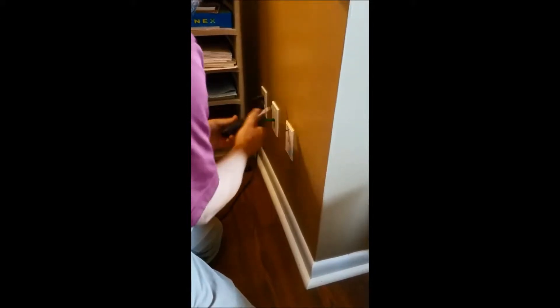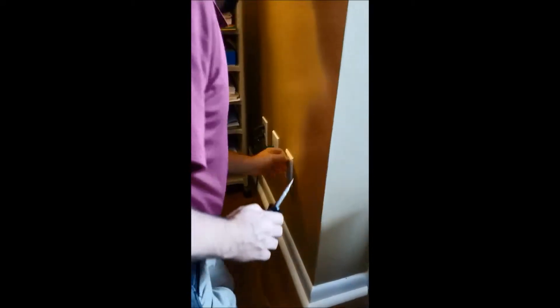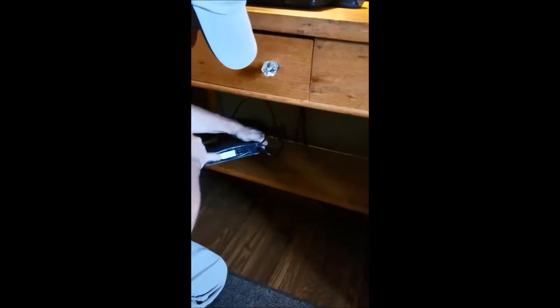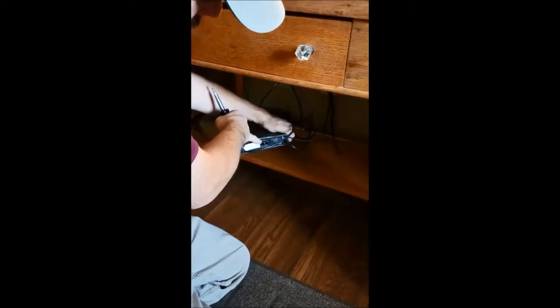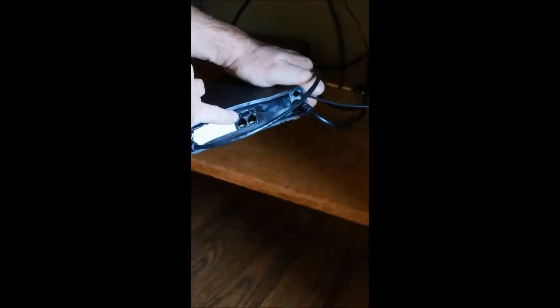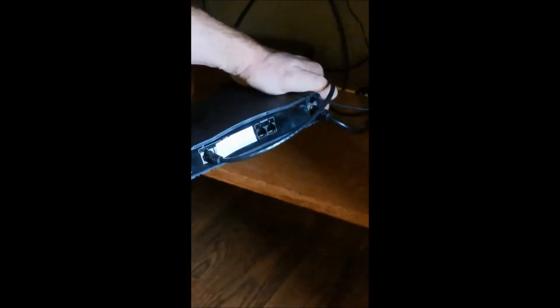During the installation of the phone we've got many options. We can hook the phone up directly to the back of the ONT. There is a phone connection on the back of the device — line one, possibly of two separate numbers. A base phone can be plugged in here with many portables, and you can avoid house wiring altogether if it's an issue. Some people like to just plug their base phone in here and have multiple portables throughout.